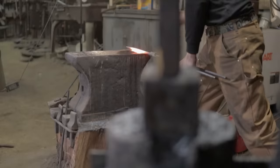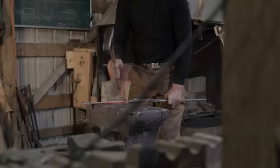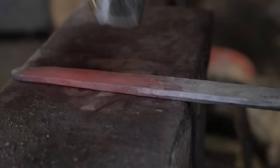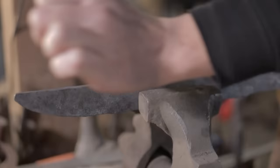The hand beveling is the stage at which more of the smith's artistry comes into making the piece, because the traces of the smith's hammer are at the same time his brush strokes in the steel. Now, the idea of the final forging is such that you should be able to take a scraper and a file and finish the blade instead of grinding it before heat treating.